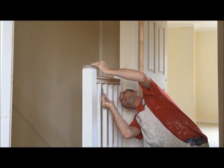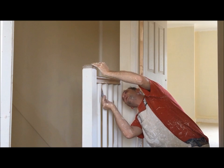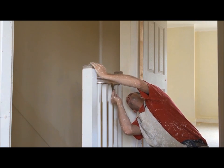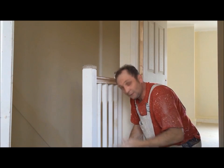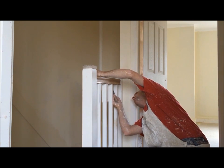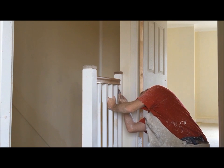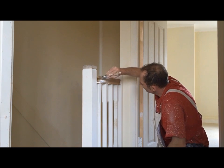And this same applies if you're doing a staircase that's in your own house that's already been painted in this manner. The same rule applies. Just do your best not to get any varnish. Or if it's a stained handrail, maybe you're doing it in light oak or something like that, just do your best not to get any stain or varnish on the pre-finish. On the pre-finished white woodwork. Okay.